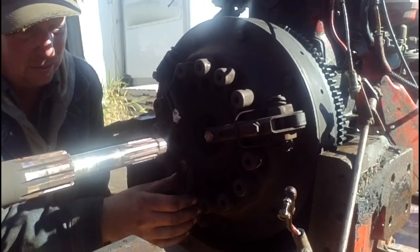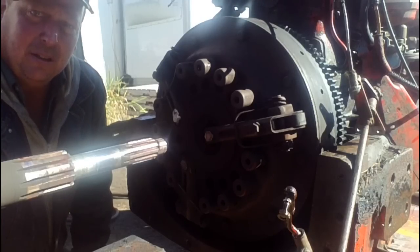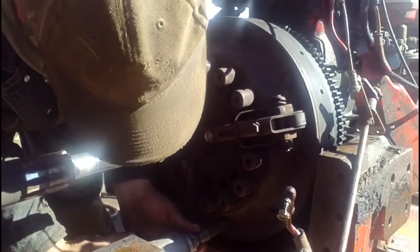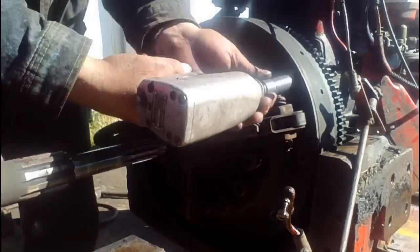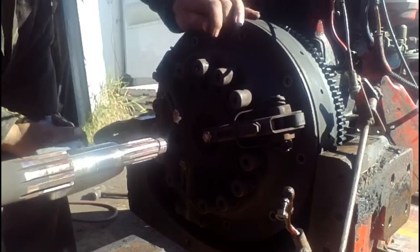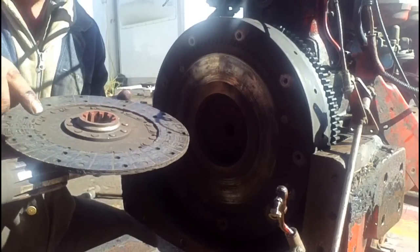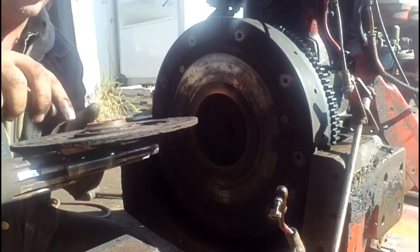You can see the fingers are in bad shape on this pressure plate. We've got a new pressure plate, discs and bearings for it. It was the transmission disc that fell out on the ground and it is quite well worn — getting pretty close to the rivet.